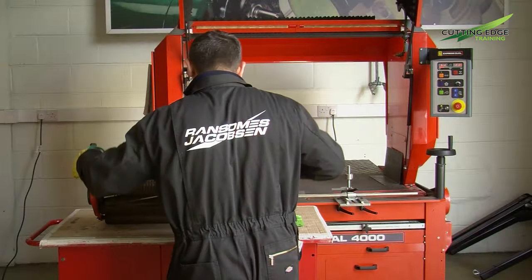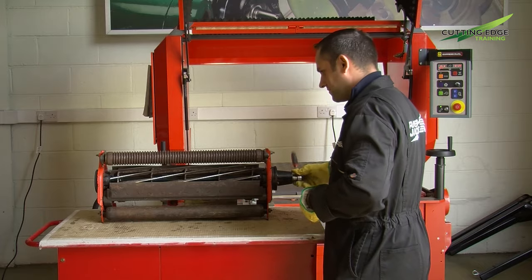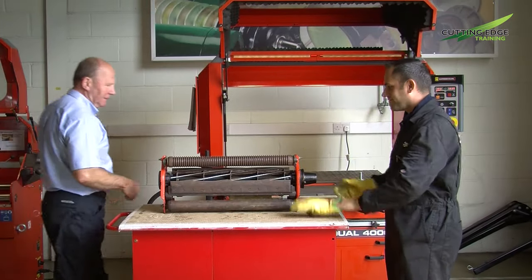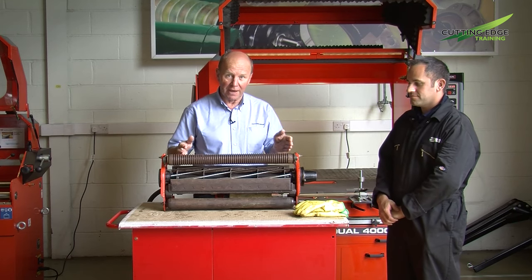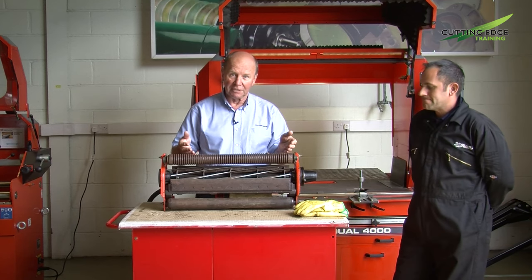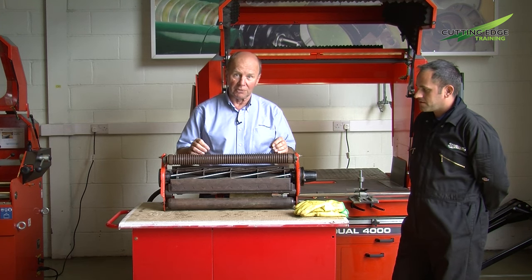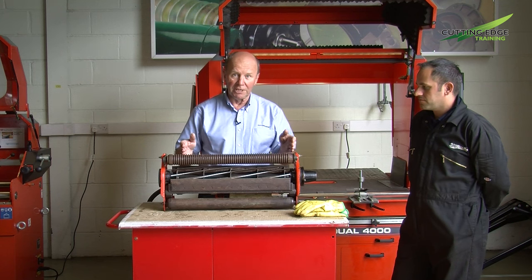The cutting unit assembly is now nicely sharp and ground, and the bottom blade is nicely sharpened and ground as well. We've now set our bed knife to our cutting cylinder and we have a nice clean cut. So hopefully you've found this informative. We've taken a cutting unit which is by no means new — an old unit we found in a shed that wouldn't cut grass, wouldn't cut paper — and through the process we've done, going through all the aspects of setting up the blade and re-grinding the cylinder, we now have a cutting unit that we could take out and use on the golf course and give a good quality of cut to the grass: a nice clean cut, no damage to the leaf tip, and we'll end up with a nice healthy sward having re-ground the cylinder and blade. Thank you. We'll see you next time.